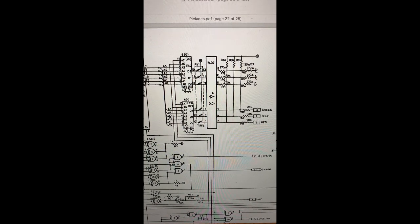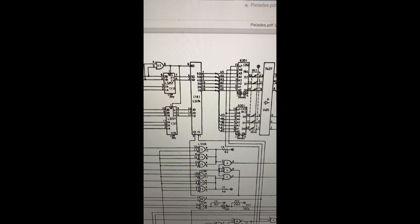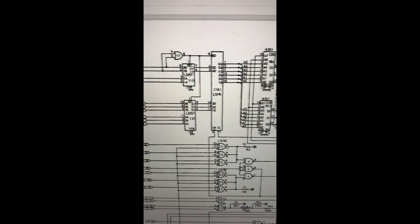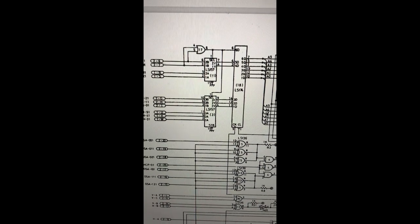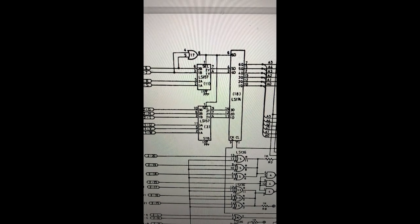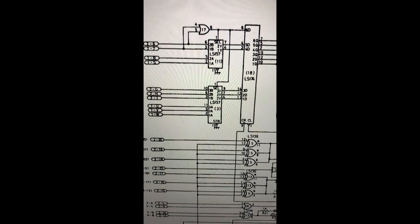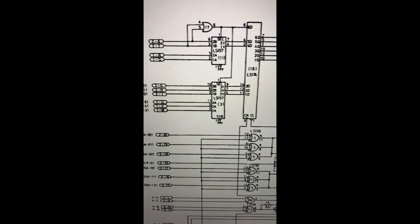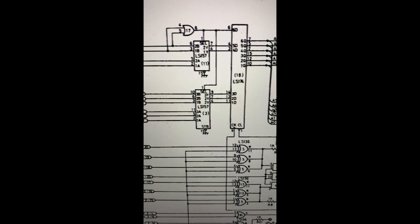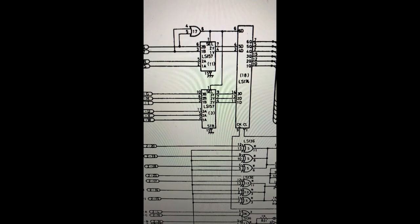I've looked at the 7407 and worked my way back. We have signals coming in from this LS174. But then we look at these LS157s, and the top one, which is chip 11, we've got signals coming into the LS174 on pins 4 and 3. But if we look at the lower one, which is in location 3, we've got 3 signals coming out of that on pins 9, 7 and 4, and going into the LS174 at pins 14, 13 and 11. They're just either dead or floating.